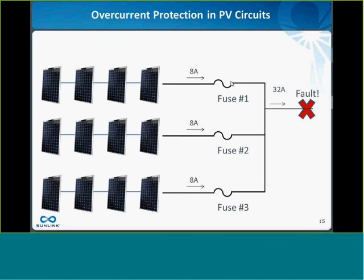So the other thing about the NEC code is that like in California, we haven't adopted the 2011 code yet. We tend to be about 3 years behind. And so I don't see anybody asking for or requiring the arc fault protection. I have seen, like in Colorado, for example, they're already in 2011 and they're asking for it.